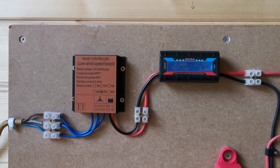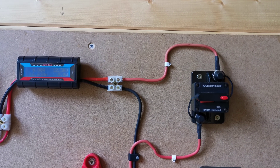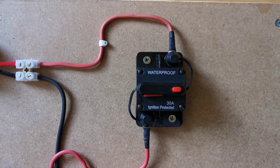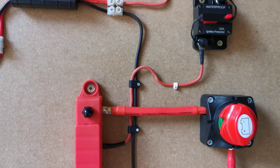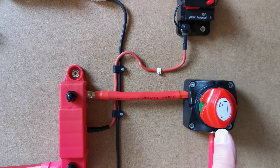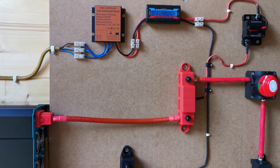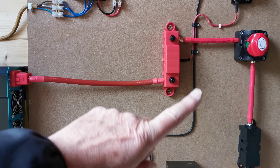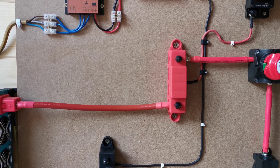So: three-phase in to the charge controller, through my meter, and then to protect the bottom half of the circuit in case the charge controller throws a fault, I put a 30 amp circuit breaker — also so I can work on the bottom half of the circuit safely. Furthermore, I've put in a massive 600 amp circuit breaker as an on/off isolator to completely isolate the middle part of the circuit. I've used positive and negative busbars for the middle part of the circuit to avoid stacking connectors on top of each other and potentially causing heat. I've got a couple of spare busbar positions because in the near future I'm going to augment the system with solar.